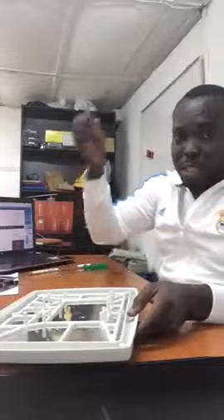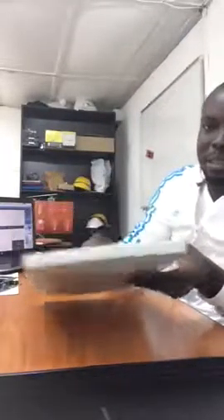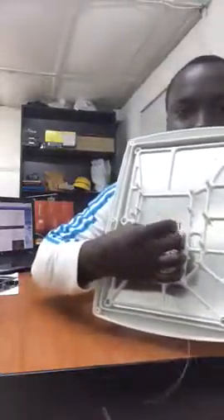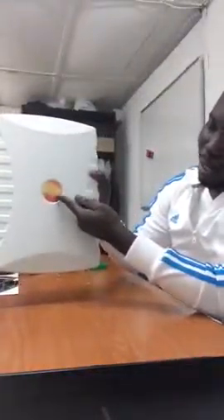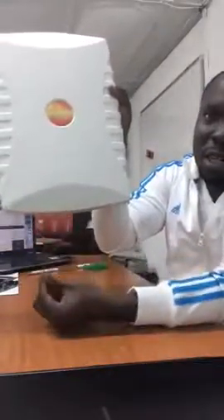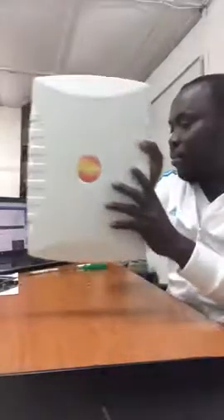The first thing you want to do is to take this pigtail antenna and fix it here, like I'm doing it right now. It's very easy. You want to check here to see that you're doing the right thing, because here is going to be the bottom of this enclosure — so that when you're plugging in your cable, it will be easier for you to plug in your Ethernet cable while this is facing upright.